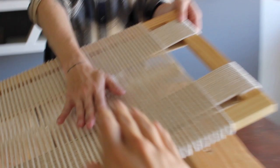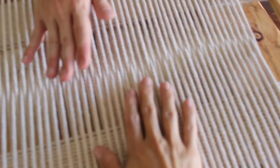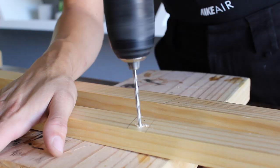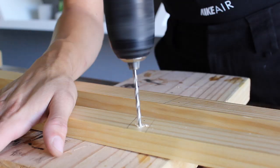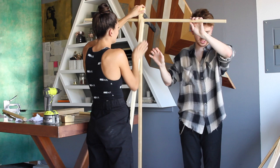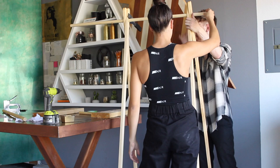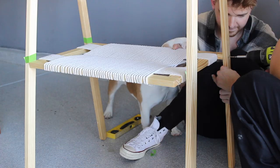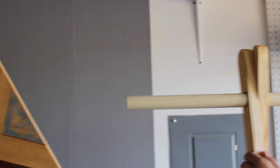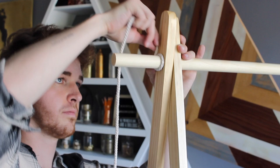This is so much better than the Urban Outfitters one — that's fully stable, you pulled it super tight. We held up the shelf to the legs, ensured it was level, marked where they were going to be, and then pre-drilled into the legs of the wardrobe rack to ensure there was no splitting of the wood, basically attaching it with wood screws right into place. When we had one side assembled, we slid in our dowel through all of the holes and clamped it into place for a dry fit to make sure we were screwing the other side into the right place. We did decide to cut down the dowel just a little bit, and Drew had a great idea to add texture to the top of this piece by hot gluing and wrapping some of the same macrame cord around the ends of the dowel.